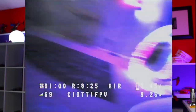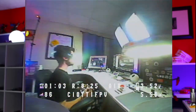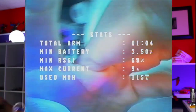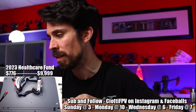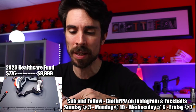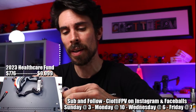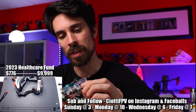I'm gonna put this onto the GemFan bi-blades real quick. They are a known quantity. There's a chance that this thing just doesn't like these Venom props. I've always been a little bit wary of these Venom bi-blades, so let's get them off and get the known quantity GemFan bi-blades that match up really well with high KV 0702s on here. Just to eliminate a potential